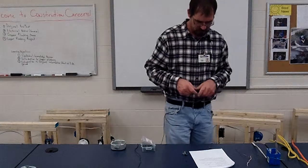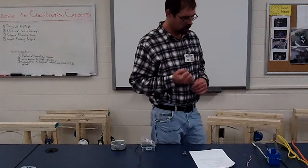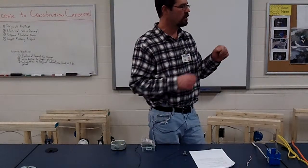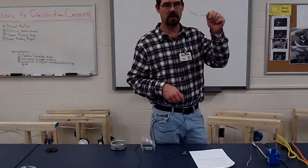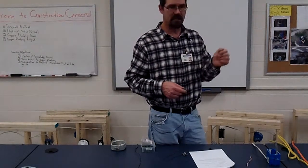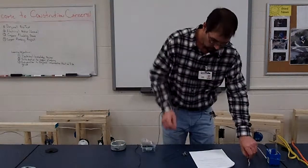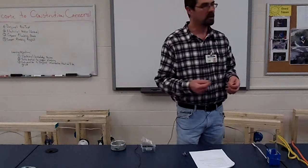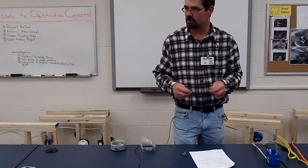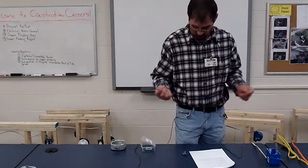All ground wires must be fastened together in an electrical box using a wire nut. You need one lead coming off to hook to the device — that's called a pigtail. Sometimes you have to pigtail whites and blacks depending on how you're hooking things up. That always has to be color coordinated — pigtailing blacks uses a black lead, pigtailing whites uses a white lead, same with ground or red.